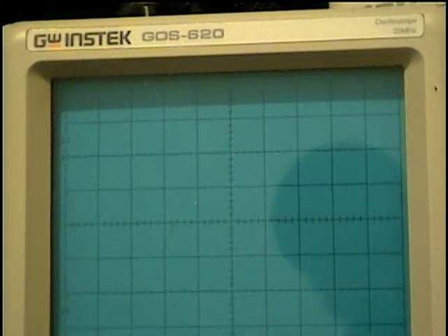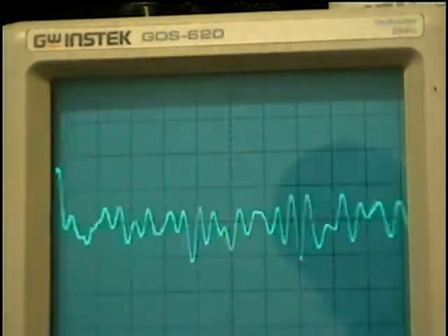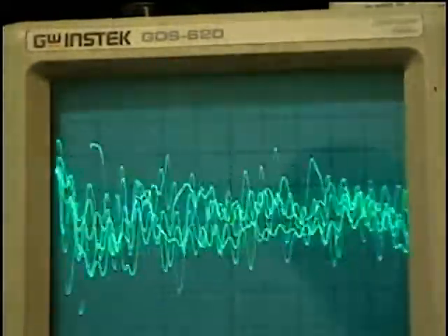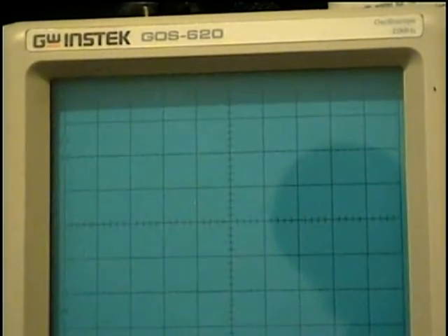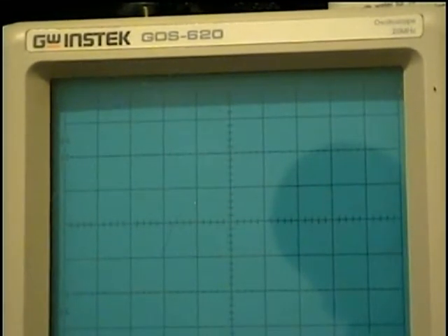We'll go back to the scope. If you have louder ones, they will really hit it hard. We could run the gain way up and demonstrate hard clipping. See, they're flat topping a lot more now. Likewise, the hum level, the background hum, is going way up as well. That's a bad signal — too much gain, too much clipping. During about the first two or three years that I was even in VLF, I succumbed to the temptation to run too much gain. It's counterproductive. But we're looking at 500-mile-away lightning easily.